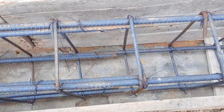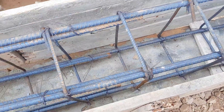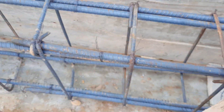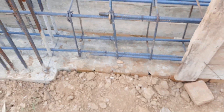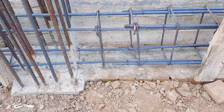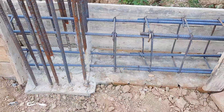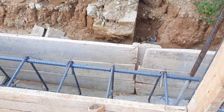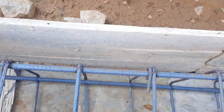If you see the ring sizes here, the diameter is 8 millimeter and hooks are bent at 135 degrees, so this is correct. But the spacing is too large, about 8 inches. At the distance of L by 4 they should provide spacing of normally 4 to 6 inches, but they didn't follow the steel structural drawing.